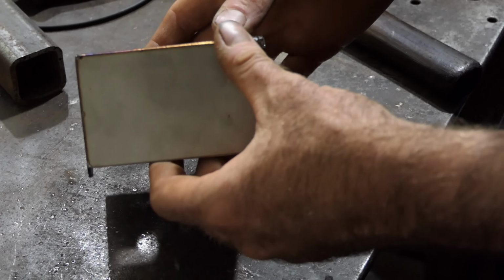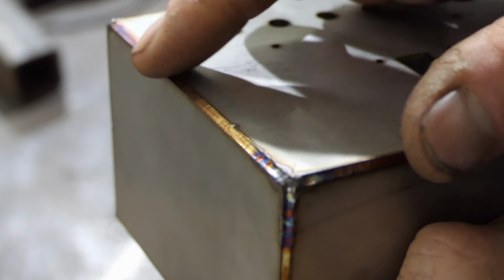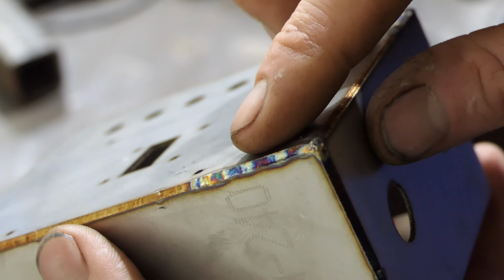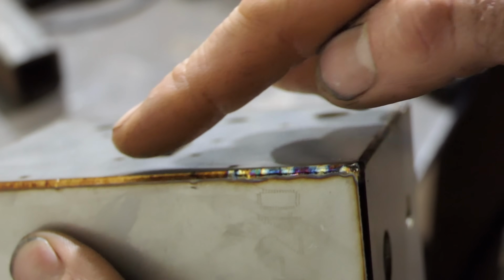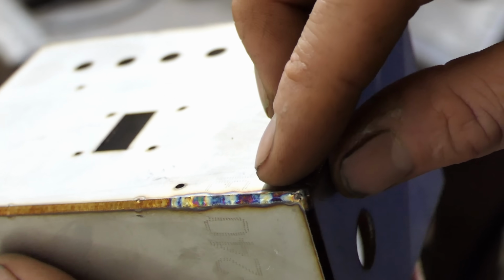So the speed of those welds is amazing. So here you are, raw, unfiltered. That's probably the best weld. Over here was a nice weld as well, but every so often you would just stall a little bit. You would have seen me just kind of like stuttering. That's because the wire feed was no longer pushing me along, instead I had to manually move along. Of course, anything manual is imperfect.